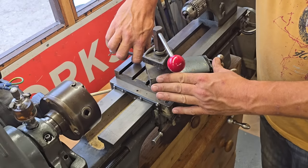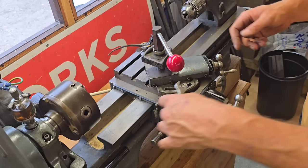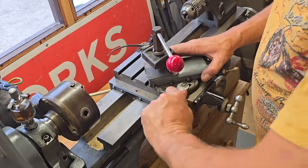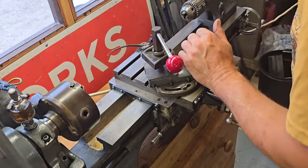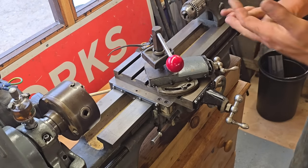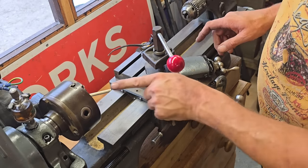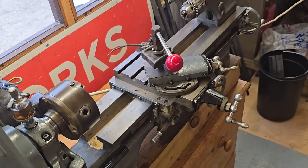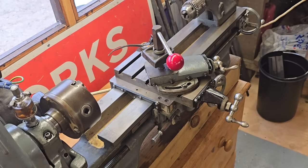So I think we've got to bolt this thing down here somewhere, because everyone seems to have these at this sort of angle, so we'll go here. Now your tool post, this is pretty basic stuff, but I'm pretty sure you've got to have the cutting surface at the centre height of your bit of metal. Now, what am I going to use? I'm going to try an old bolt, something that's not that important.